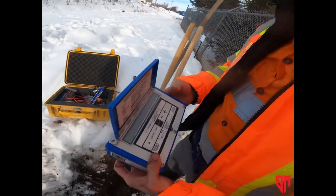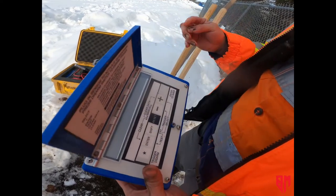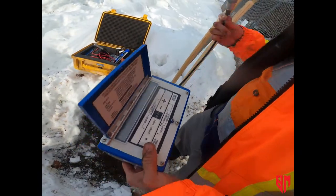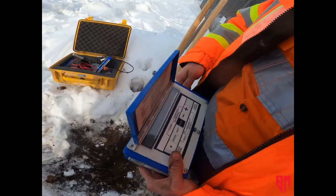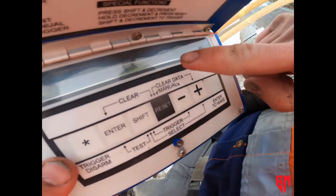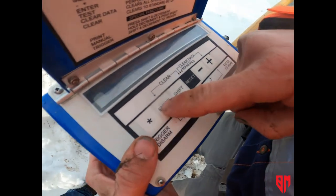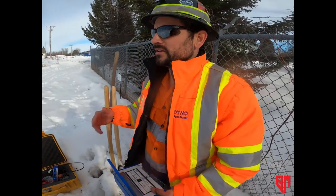The controls are pretty simple. To turn it on, you actually plug in the geophone or the microphone. We'll plug in the geophone, make sure it's clean, plug it in, screw it down. It'll come up and say something about the last calibration date, then it'll let you select what you're recording. I'm going to do wave shape. You can also do a bar graph, which every certain timeframe — like every 10 minutes — plots the highest vibration it records.